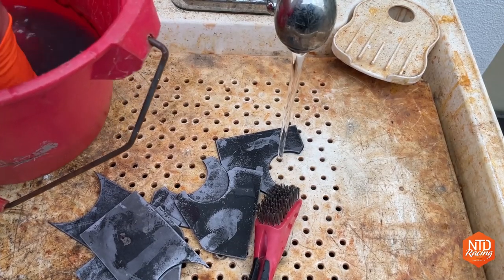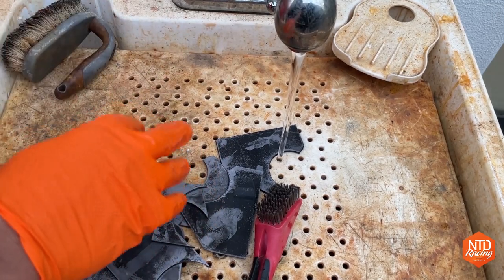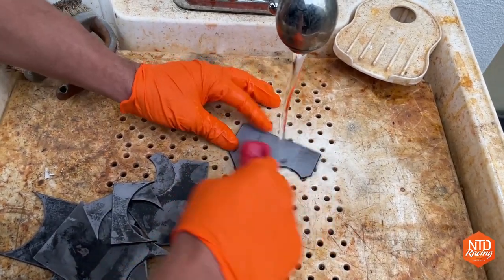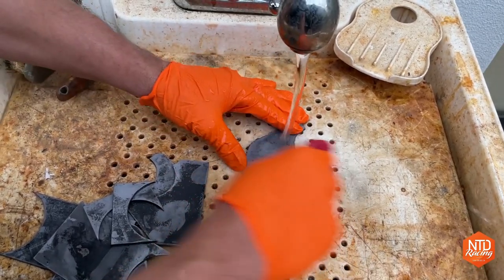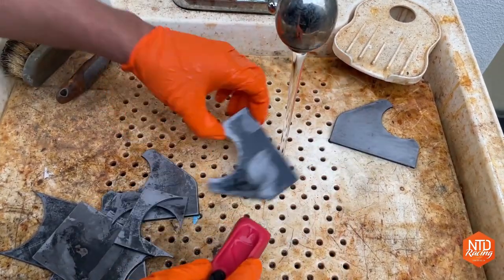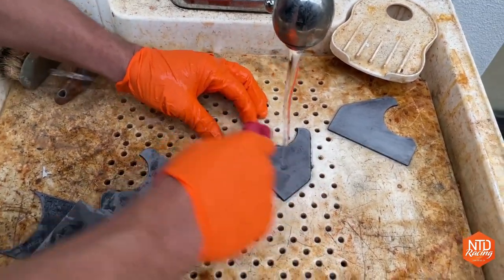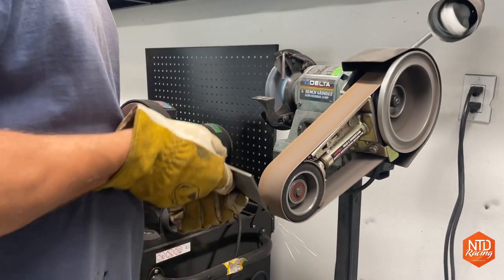One of the questions I get all the time is what kind of metal do I use when I'm fabricating? In this case I'm using hot rolled 11 gauge steel, and when I'm done with it on the plasma table it is pretty much ready to MIG weld — you generally just don't need to clean up the part to MIG weld. But all the stuff I generally do will be TIG welding, so you need to clean it up and have bright shiny metal. To get there, I will soak the parts in white vinegar — the stuff you get from Walmart for about $2 a gallon — for about six hours. After that I'll take it out and hit it with a wire brush, and that takes all of the mill scale right off of the part.